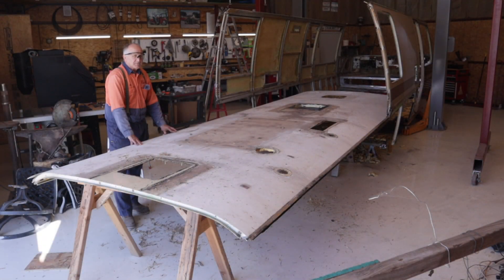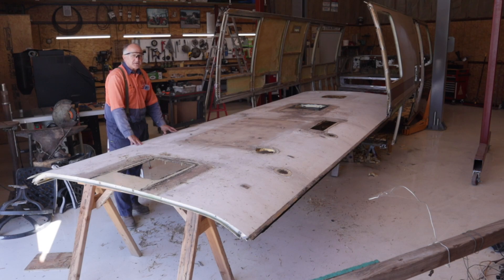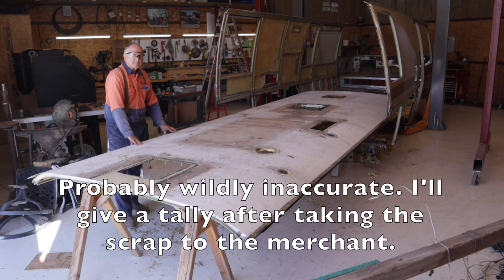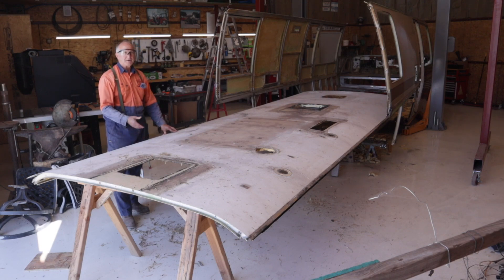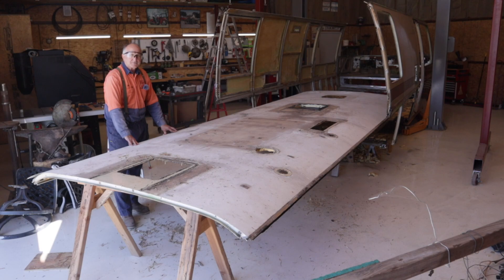Based on my cursory research, sheet aluminum is worth roughly 25 cents a pound, and extrusions are worth about 65 cents a pound. There are qualifications — some of it has paint, it's dirty, and any ferrous iron in it makes it worse. It's hard to get that out at the scrap place, so you've got to get that stuff out and they'll give you more money for it.